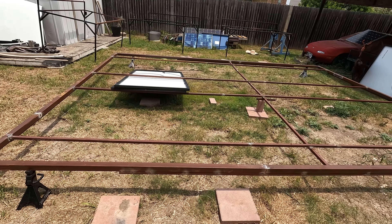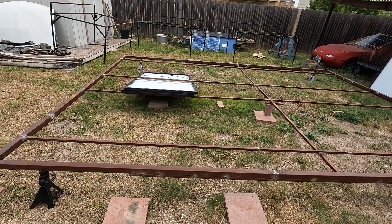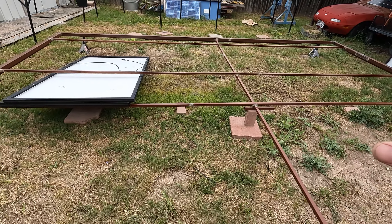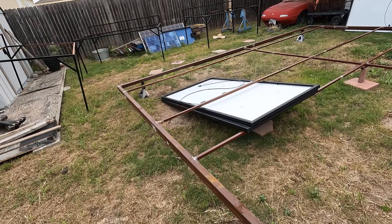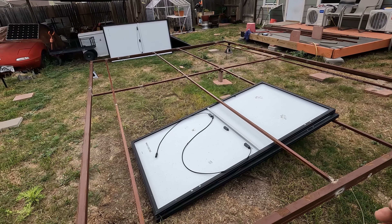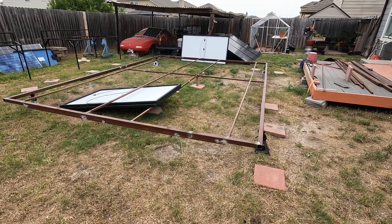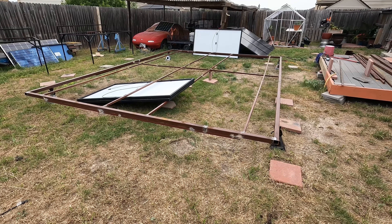The problem I'm dealing with is that this tubing — because it's only 14-gauge — is kind of flimsy, so I'm going to have to back it with something. I went to the steel store and bought some inch-and-a-half by quarter-inch flat bar. My plan is to put a piece at the bottom facing vertically to give it more stiffness, all the way around the bottom, and run some support pieces to stiffen this thing up. I don't want this thing to be saggy or flexy. I actually had to put something in the middle just to hold the center up. Once it's all gusseted and welded solid I think it'll be mint. The basic shape is done and I'm really happy with it — this was the hardest part to get to.